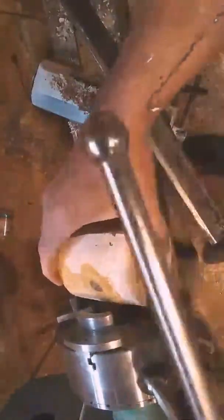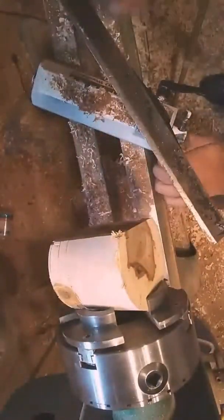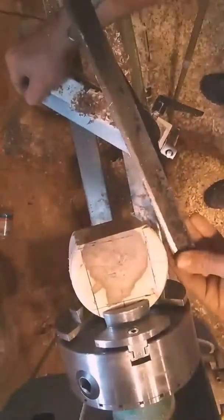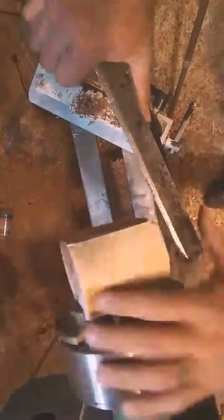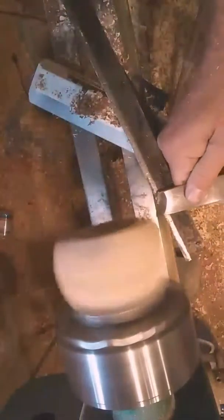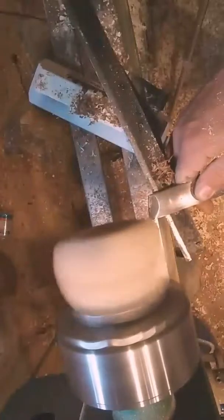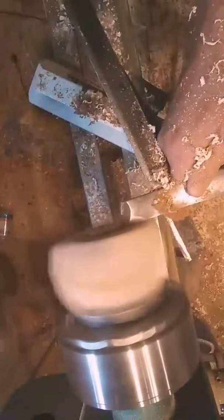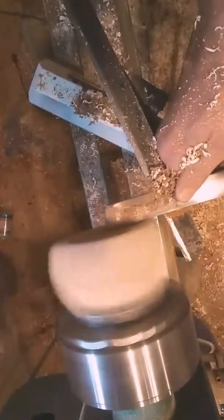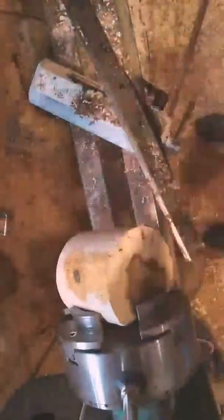It scared me. So here we're just resetting again. I'm kind of forgetting which direction I'm going. I don't like having the tool rest too far away, and with it not being round, I've got sections that are farther from the tool rest than my starting points. You'll see me with the pencil — what I do is darken the line, because as I'm turning this and getting it down, I can actually see the line in the shadows, the outline of it as it's spinning.